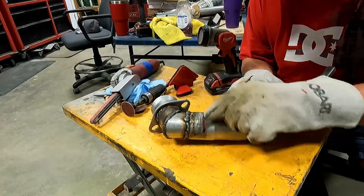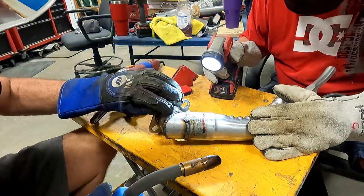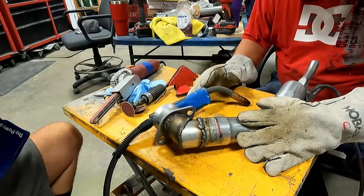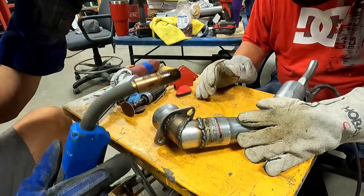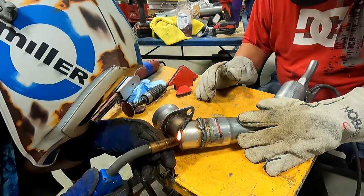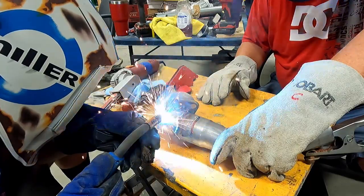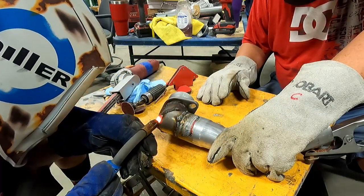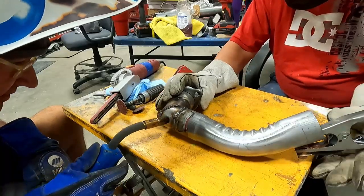All right, we're gonna put a little bit better weld in like three little places where it was bubbling. Try to, at least. So, I think I'm gonna come along this line right here. Having four leaks with four connections, that's not bad. 99% done, it's just that one little hole. Everything else was sealed. I'm gonna come on the back side of that too. Probably get that. Now I want to come up along that line right there. I think that's suspect.